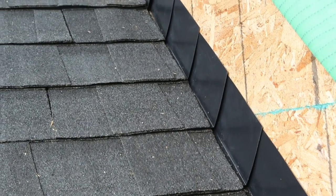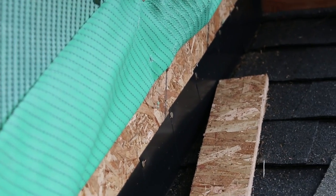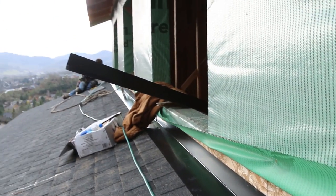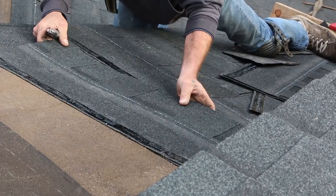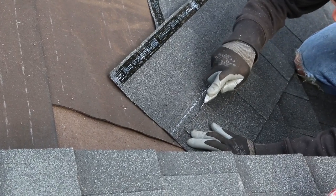These pieces of flashing are called step flashing, and they work just like a shingle, one piece at each course. And each little piece of flashing overlaps the nails on the flashing piece below it, creating a little gutter against the wall line. In other places on the house, we've used sidewall or end wall flashing, pretty much just a big piece of L flashing in 10 or 12 foot segments without all the little steps.